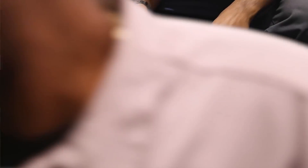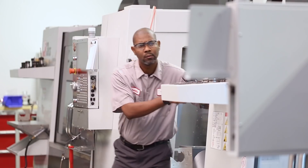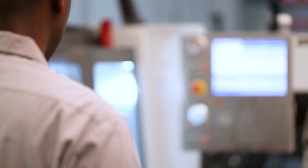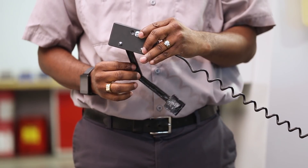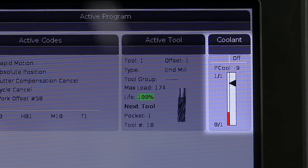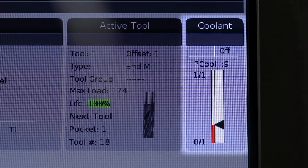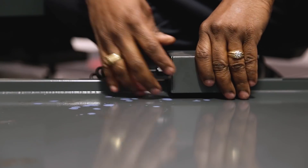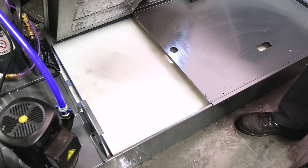While the spindle is warming up, let's check out the coolant system at the same time. Pull the float level assembly from the tank and check the coolant float sensor against the coolant level meter on the control. Pull the float all the way down to simulate the tank is empty, then push the float level all the way up to simulate the tank is full. Put the float back in the tank and check the actual coolant level — service if needed.